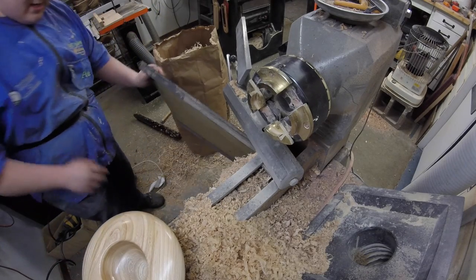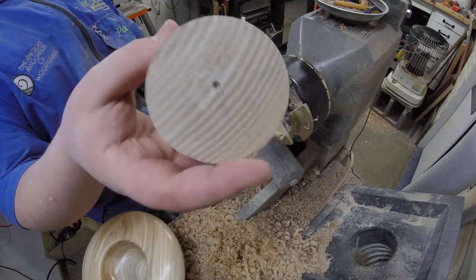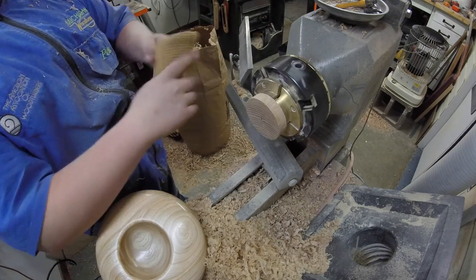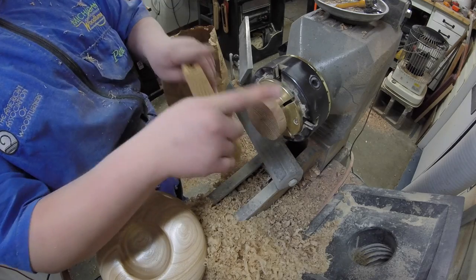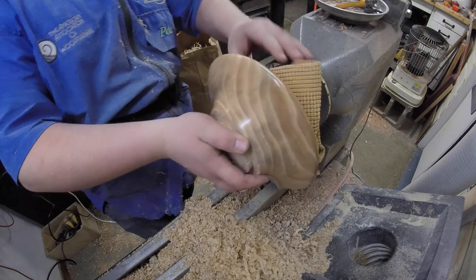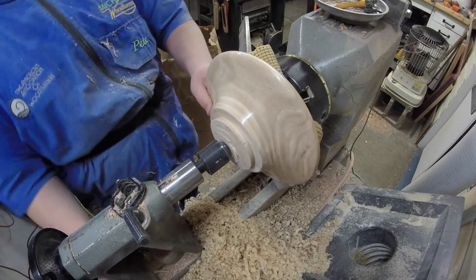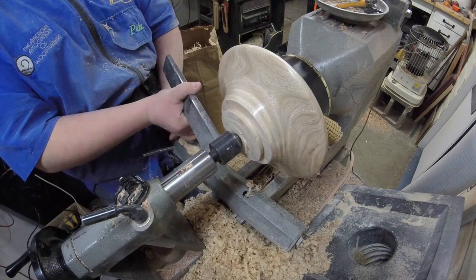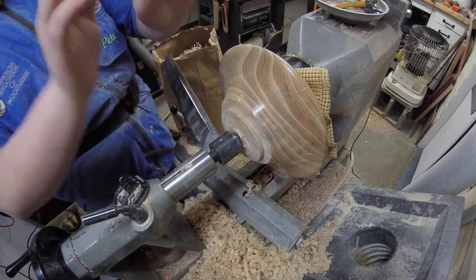Now that I'm done ranting about how great this finish is, we can go ahead and get out this little work of art — the wooden jam chuck. It's literally a piece of wood with a tenon shelf and drawer liner. This is key — absolute key — in getting successful results from your wooden jam chuck. Without this, the fit won't necessarily be different, it'll still grip the wood, but it'll really mar up the inside of your bowl and leave a little mark. This stuff helps cushion and protect the wood. We bring up the live center to the original center hole, make shelf and drawer liner adjustments, and make sure you have good pressure in your tail stock. I've brought up my tool rest — we're gonna go ahead and turn off the tenon.